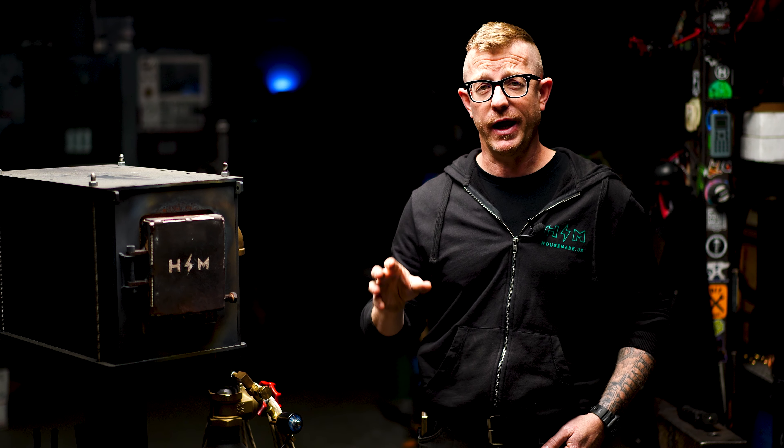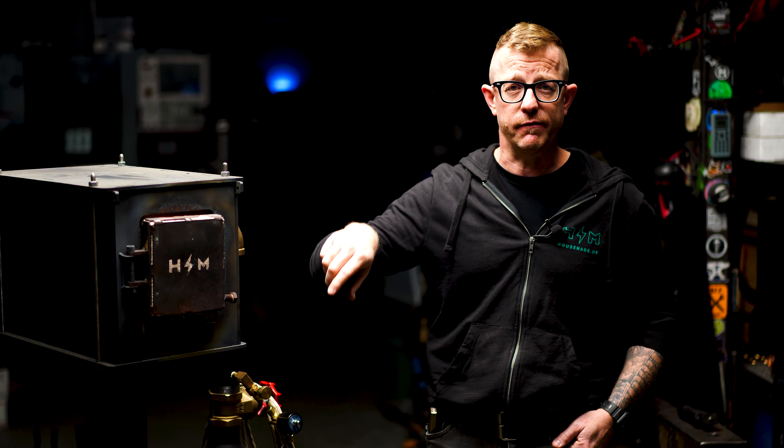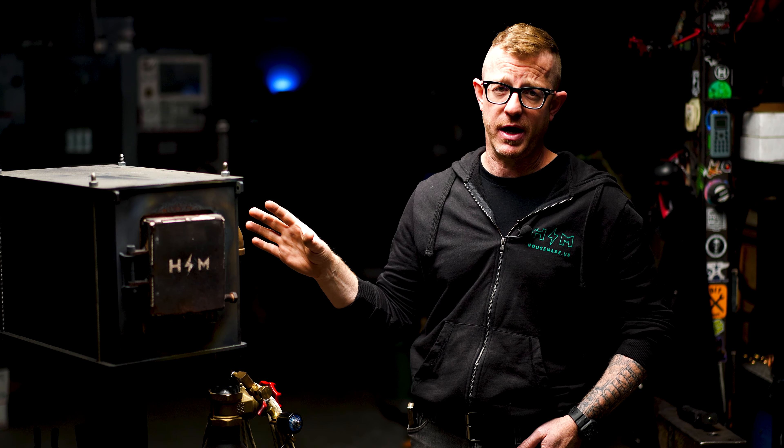You see me firing this forge inside an enclosed building — between shots I'm opening the garage door and blowing in fresh air with a fan. Also, never walk away from a forge that's been fired or is running. At the very least, ensure there's a good 5 to 8 foot radius around it clear of all combustibles.